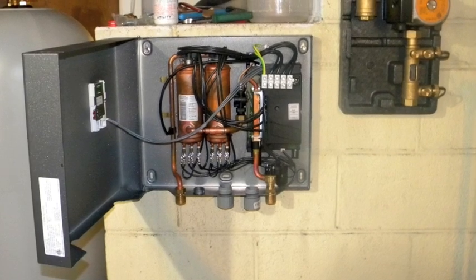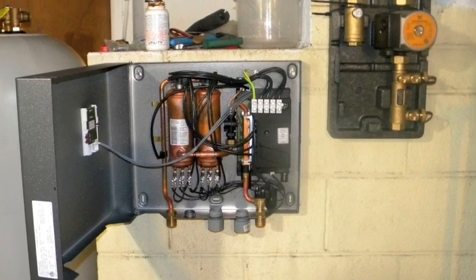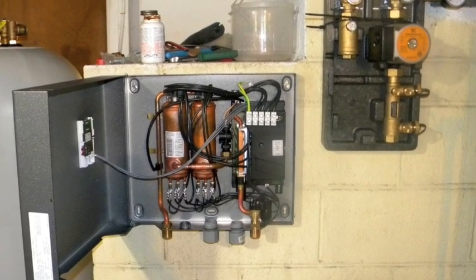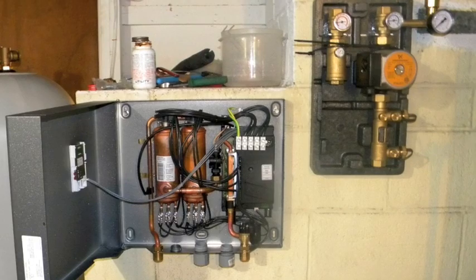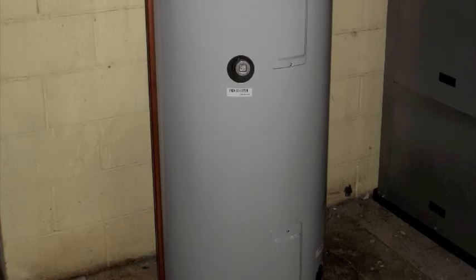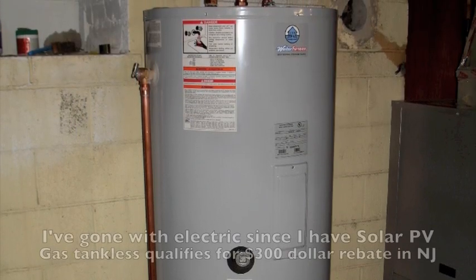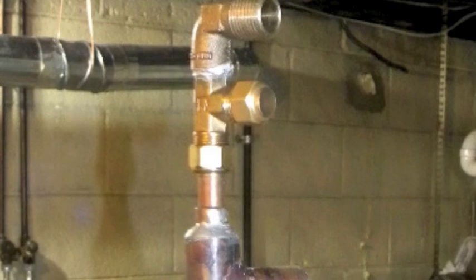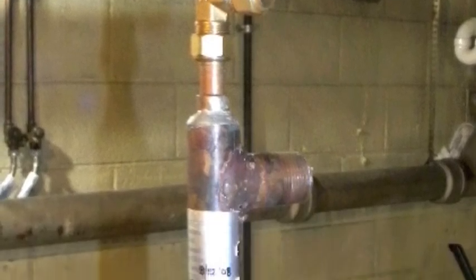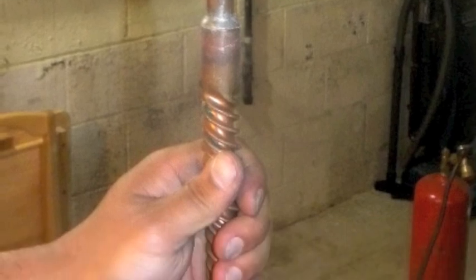It's time to move into the basement. Just like the outside, there are many ways to get this accomplished, and sometimes there are cheaper ways with existing equipment. However, what I'm going to show you today is the most efficient way to do this. Here we are installing an 80-gallon solar storage tank without any secondary heating source. However, this tank will supply a tankless heater that will, if necessary, add additional heat without the issues of standby losses. Step one is installing the OG300 Butler Wand heat exchanger. It exchanges heat passively, so there's no secondary pump needed to run electricity in order to exchange heat from the collector into the tank.